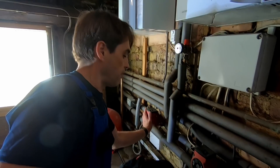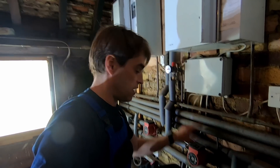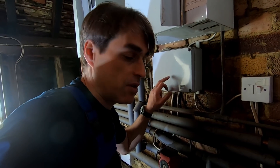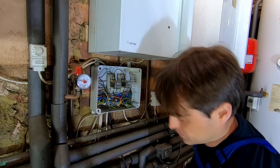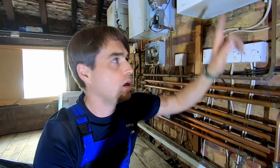Zone valves are closed but both pumps are running — so there are contactors or relays but they're not wired correctly, because every single pump is on, which shouldn't be the case. That noise — that's a faulty contactor, probably a relay, not separating the pumps correctly. They're coming out anyway. Nothing sounds healthy here. I'm sure the owners are glad this whole kit is going.